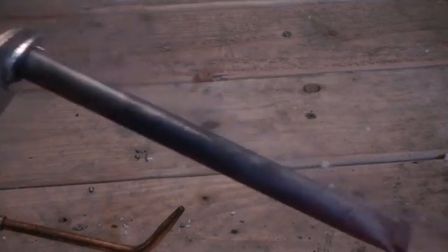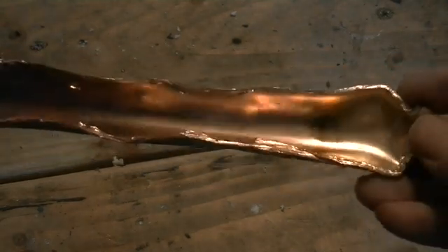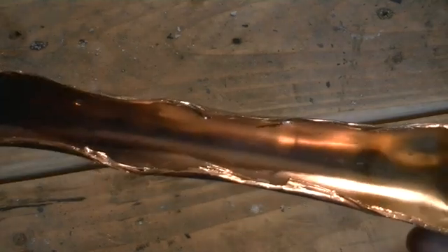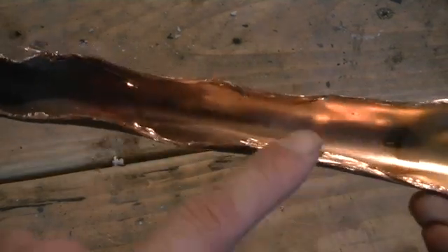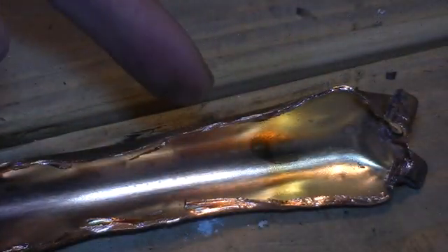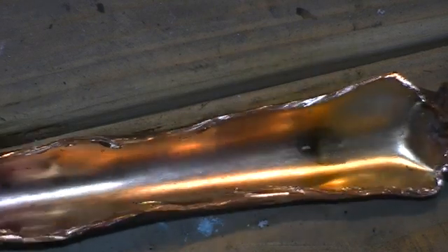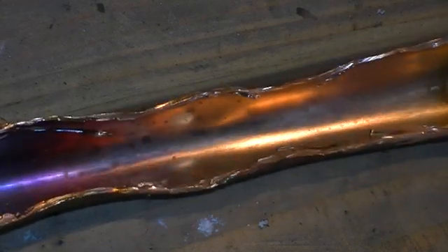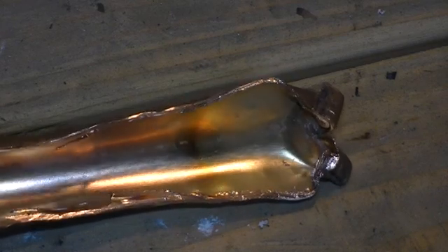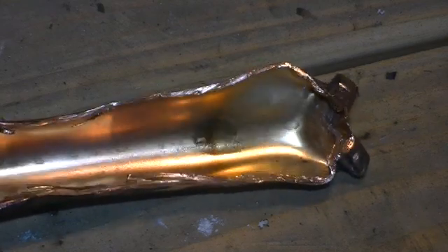After the tube cooled down, it was slit open using an angle grinder, the powder was poured out, and the tube folded open using a pair of pliers. With correct lighting, it is possible to see a brass colour at the base of the reaction. The copper metal towards the base also looks very shiny — our charcoal was not only reducing zinc oxide to zinc metal, it was also reducing copper oxide to copper metal, giving a clean surface at the base of the reaction. I believe this is sufficient evidence to show that charcoal can reduce zinc oxide to zinc metal.